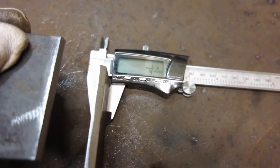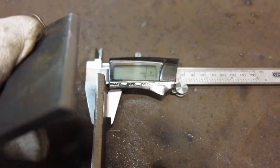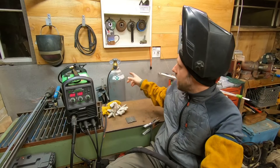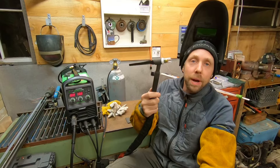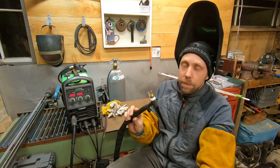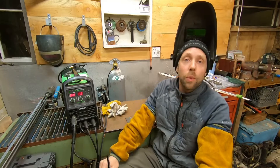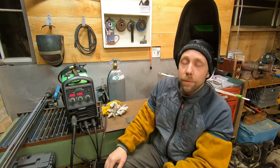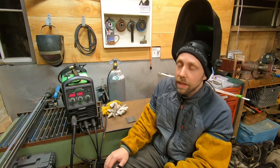We're going to be welding some quarter-inch plate here and we kind of ground it to a V to get a little deeper penetration. We got the Titanium set to about 160 amps and increased the gas flow to 15 cubic feet per hour. You guys might be noticing I'm welding with the Pyrex cup. I got this cheap cup kit on Amazon — there will be a link below. It was around 20 bucks. I didn't think it was going to make that much of a difference, but you may have seen the other video where I tried it out and I was really surprised.